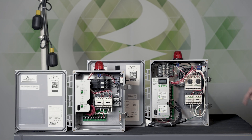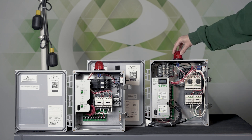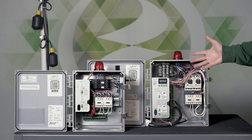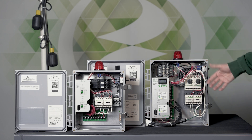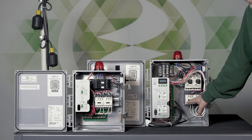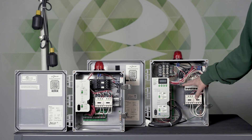Let's look at the components on the Pivot Pro. Obviously you have an enclosure — the globe. This is a silence and reset button: push it down once to silence, push and hold to clear any stored alarms. That's important for a first-timer walking up to the panel. There's a horn right here, and inside the panel you have your ground lugs, contactors — this is a duplex so you have two contactors and two overloads.